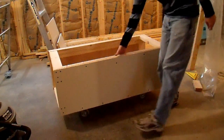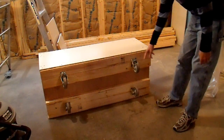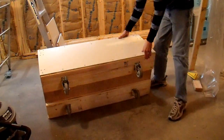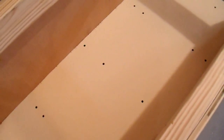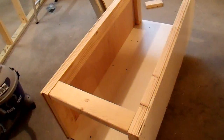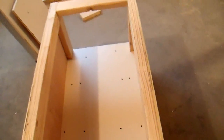This is the actual battery box, and I've put it on some casters that I had shown in an earlier video. These are rated for 260 pounds apiece. It's a piece of plywood on the bottom with a couple of 2x4s on each side to give it strength, because this will weigh 700 to 800 pounds by the time I'm done and have it filled with batteries. This is what it looks like inside — it's just a pretty simple box. This thing by itself probably weighs 60 pounds already.